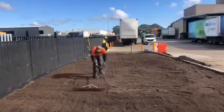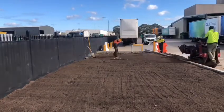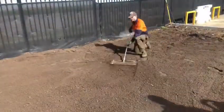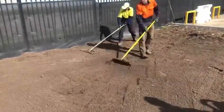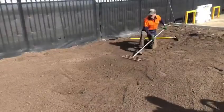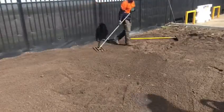The second key factor to preparing a great grass seed bed is making sure your grades are perfect. You do not want any low or high spots in your final grade. Not only will there be lumps in your final product, but those low spots will puddle when it rains. For proper watershed, the rule of thumb is 1 inch of drop for every 8 feet of run.